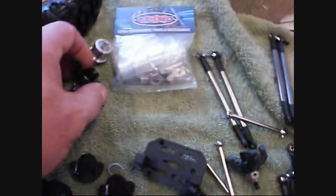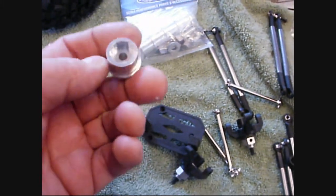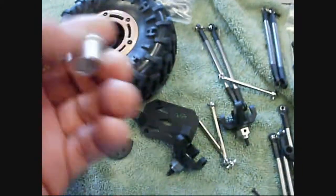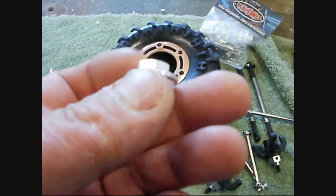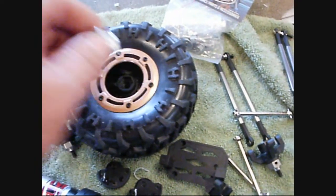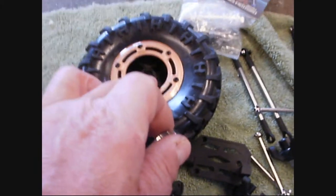A little news flash: when I went up to the house to get more batteries for the camera, the RC4WD wheel wideners arrived. They fit the wheel okay, but they do not engage all the way. An easy fix for that is to put an O-ring around them. I didn't see any O-rings in the packaging — I see washers and barrel nuts. This little groove right there would be ideal to put a washer on to get a really good contact patch.